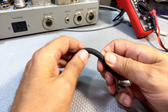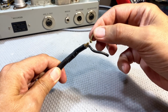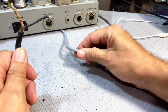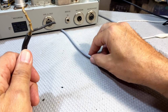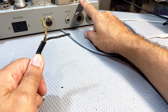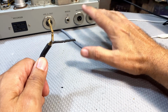This is what the cable looked like, and as you can see, it's completely brittle. This was going into the plug, and it's just breaking apart. So I put in a 3-wire cord. I've put the original plug back, which has only got 2 pins. So I've got the earth wire just tied up on the inside there and cut off at the plug. If I want to make the chassis mains earthed, I can just change the plug and we'll decide how to go from there. It all depends on what sort of noise we get. So that's already done, and this thing is ready to power up.